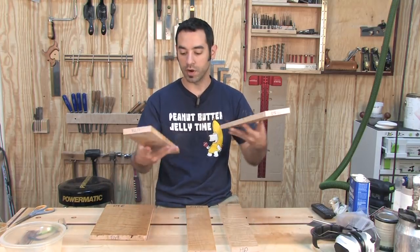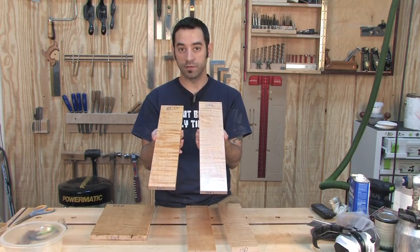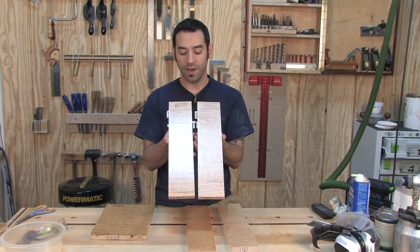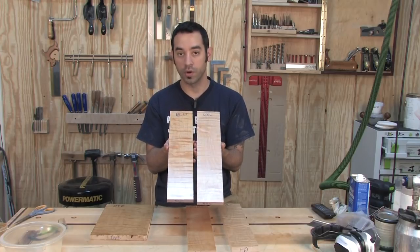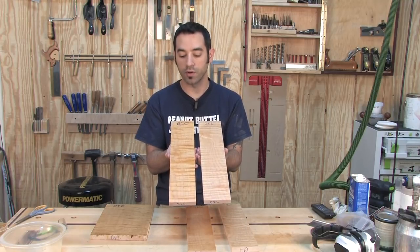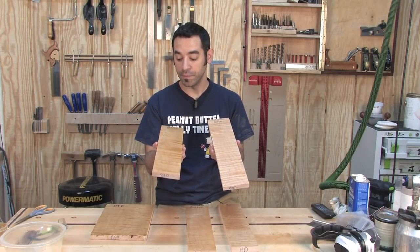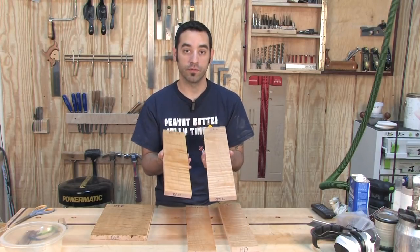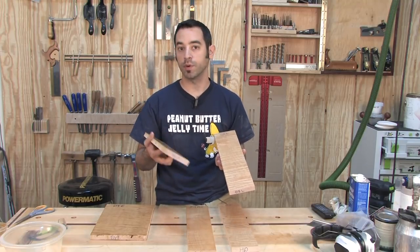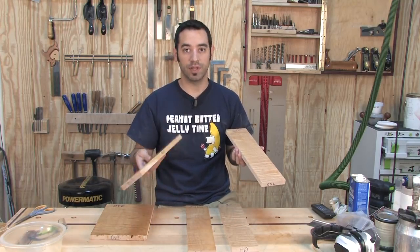Here's an interesting comparison: boiled linseed oil versus the oil-based varnish. Boiled linseed oil gives a very intense amber color — this maple has turned a very orangey, yellowish, light brown color. You can certainly get there with a pre-coat of boiled linseed oil, but you need to be careful about adhesion issues. That shellac barrier should do the trick, but it becomes a three-step process just to use a water-based finish, so it may not be the best option.